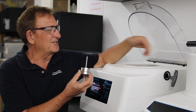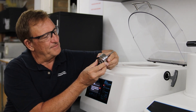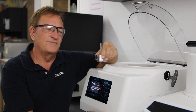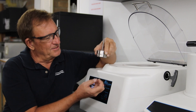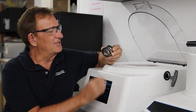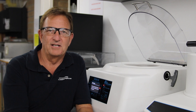We do put a mechanical leaf spring on the motor, which is a PZT motor by the way, and that allows the sample to actually rotate around. As you increase the voltage of your polishing operation it'll move a little bit faster, but the polishing action is still from the vibration of the particles against the bottom of the surface, giving you the ultimate finish — particularly for samples being put onto an electron microscope.